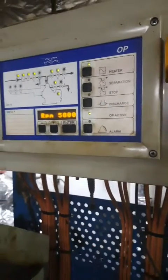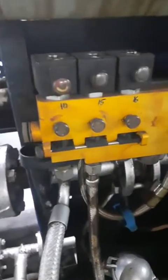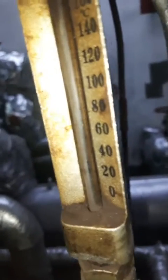It has reached now 6000 RPM. As an observation: if you find very abnormal noise, just stop the purifier instantly — don't take risks. This is the water block and the solenoid valves. All parameters are good and the temperature will also be increasing. Check for any leakages and abnormalities. The temperature is now around 85 to 90 degrees and purification temperature optimum is 95 to 97 degrees.